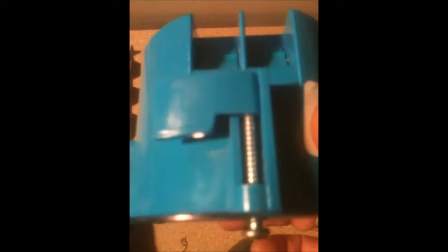Tape measure. Here's an old work box. I don't know if you're familiar with what that is, but if you need to do a job like this where it has to be pinched in between sheetrock or a new piece of wood, you use this and you just simply adjust it with these screws, and these clips clip down. This is a box you cannot use on this job. Just want to let you know, if you have the square brackets for your track lighting, it will not fit in this type of box. So don't go crazy trying to use it.